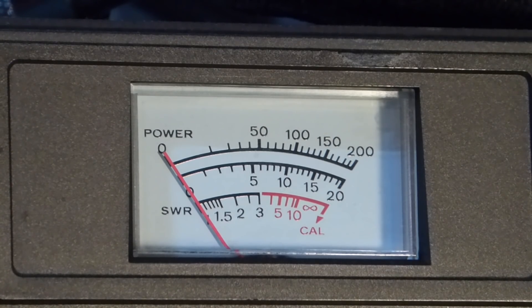Number 2: understand the concern in regard to reflected RF power. Reflected RF power is measured by what is called the standing wave ratio, often referred to as SWR. Very simply put, SWR is that percentage of RF power that the transmitter sends out to the antenna, but which does not get radiated by the antenna, and instead travels back down the coax and into the antenna jack on the radio. This phenomenon occurs when the antenna system does not present a perfect impedance match to the transmitter. When the SWR is high enough, it's an indication that a problem exists, which could possibly damage the transmitter.